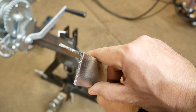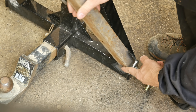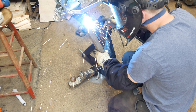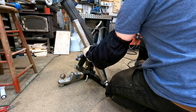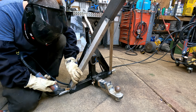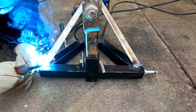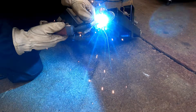I put a little bit of a bend to the angle iron there — I noticed it just fit a lot better mocking this whole thing up before I welded if I put a nice bend to it. Keep in mind I built this and scaled it for my small 18 horsepower tractor. I didn't over-build it for a 50 horsepower tractor pulling 30-foot logs. I just built it heavy enough to hold up well for the work I plan to do with it — I try to balance out everything: weight, size, and function.